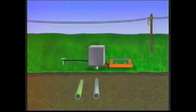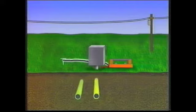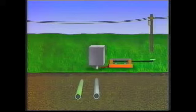Make sure that the ground wire does not lay across or too close to another buried conductor. This may cause the signal to return on an unwanted conductor or create signals that make it difficult to isolate your target. If this happens, move the rod or plate to another location, away from the unwanted conductor. Although this may reduce the signal strength, it will help isolate the target.